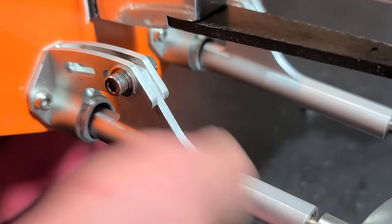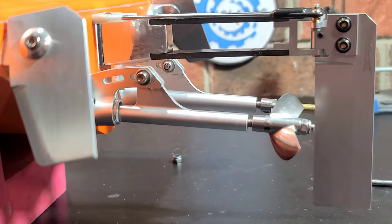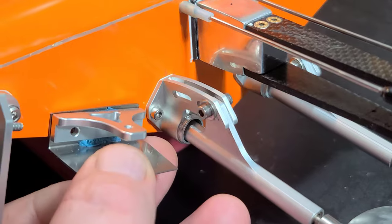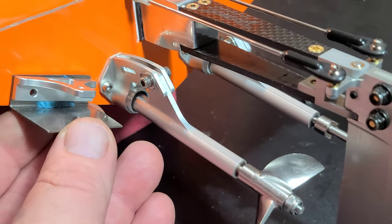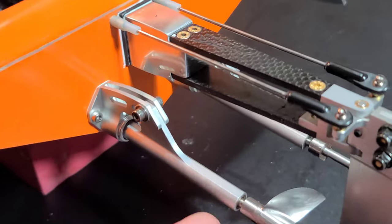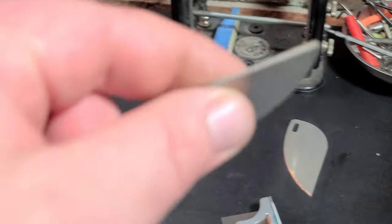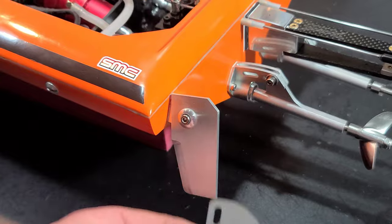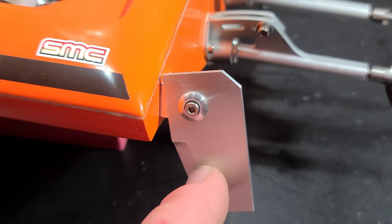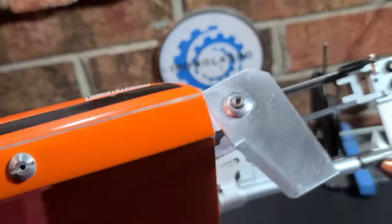I filed some off the elongated hole on the barrel to get the stingers to drop down low for angle adjustment. Initially I won't run trim tabs — I'll get several runs in first using stingers and weight distribution to tune the boat, then probably install trim tabs. I'll also try the Mad Lizard turn fins and swap between the two. The Speed Master turn fins have leading-edge angles cut on both sides, which should be interesting.